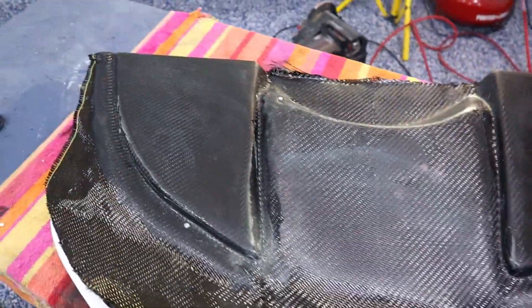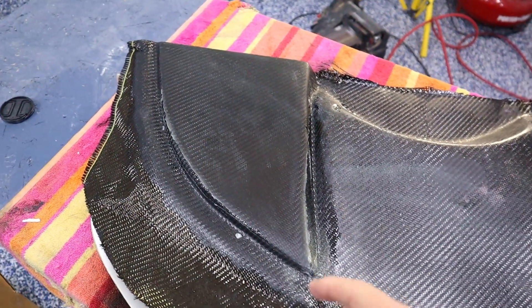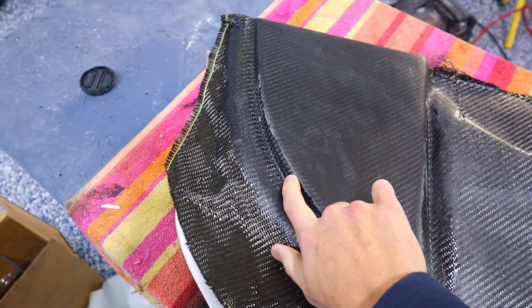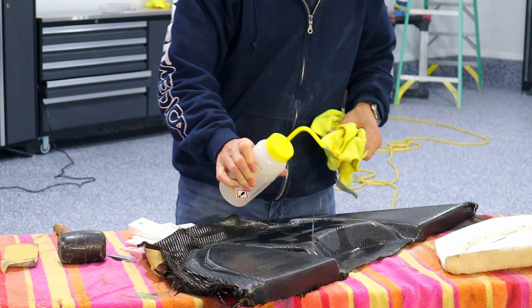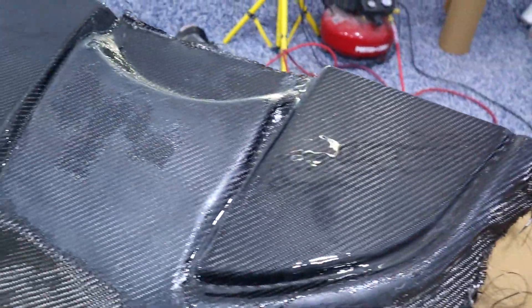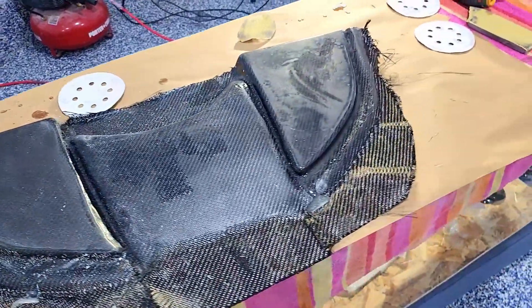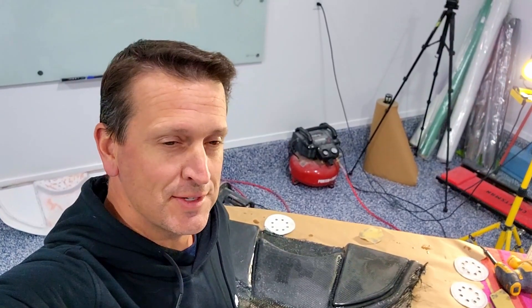Here's the part - it looks pretty good. There are a few places where I've got some bridging. That's places where I didn't get the fabric quite down in the corner enough. It's not a strength issue, it's just a cosmetic thing. What I'll do is break some of these corners, go over it once more with some epoxy, let that set up, and get it ready for clear coat. After some cleanup though, this is just not going to be quite up to my standard, so I'm going to go ahead and do another layup. On my channel I show you the entire process, not just the good parts - I've got a lot to learn and we're just going to do it again.